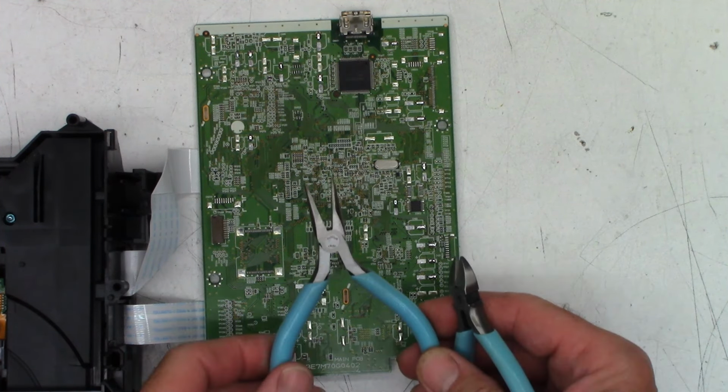I was busy showing you guys stuff. So let's hit display. And it knows it's a -R. In the SP mode, it has 2 hours exactly left. So I'm going to go into the record mode right here. And I'm going to change it to the 1 hour mode, the HQ mode. So let's turn off the display. Let us get into the menu here.